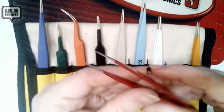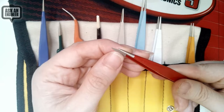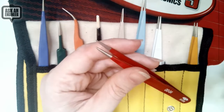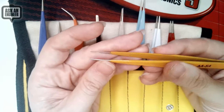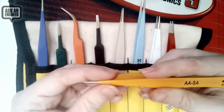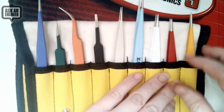This one's a little longer with a slightly duller tip — not super fine, but that's okay. Again, for larger components you don't want the fine tip because parts will flip on you very easily. So a lot of nice options. I like that they're color-coded, so you can reach for your favorite quickly. If you want to replace it, you know what color to order. Easy to find, especially if they get mixed in your tool bin.